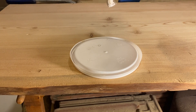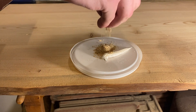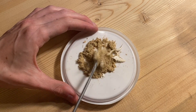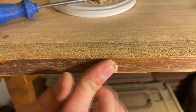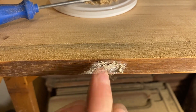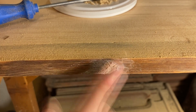Next time I'm definitely going to spend more time in the planning phase and decide what I want from the beginning. Here I'm mixing up thick wood glue with sawdust and using this paste to fill every single hole in the wood — that took ages. The paste worked beautifully; I filled every screw hole without much trouble and it dried quickly so I could sand it down fast.